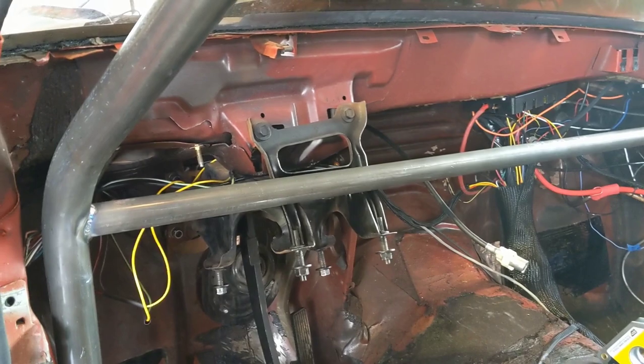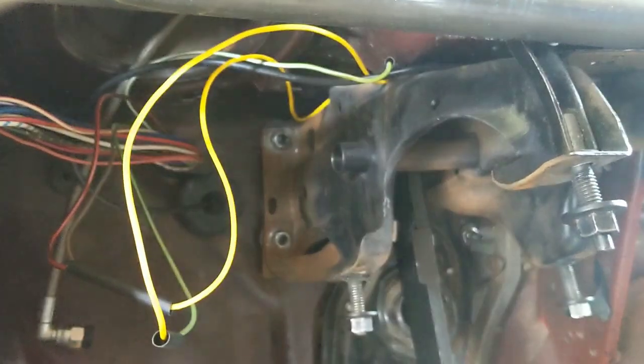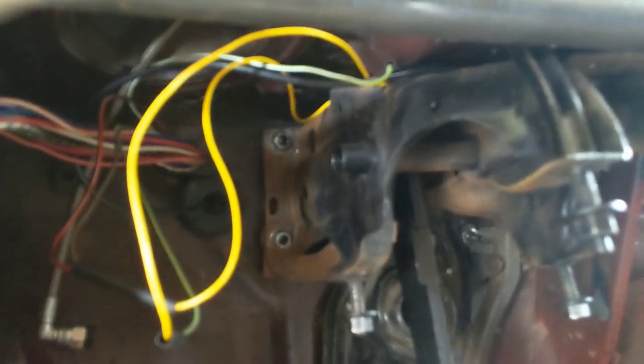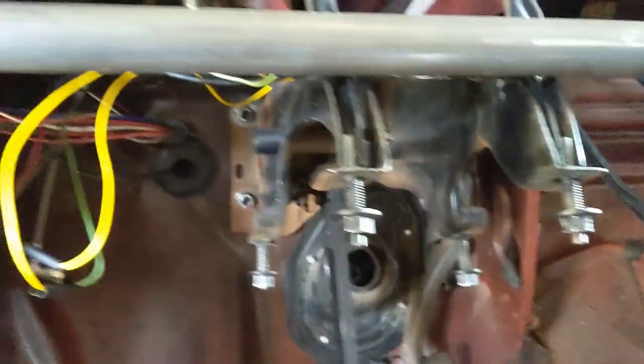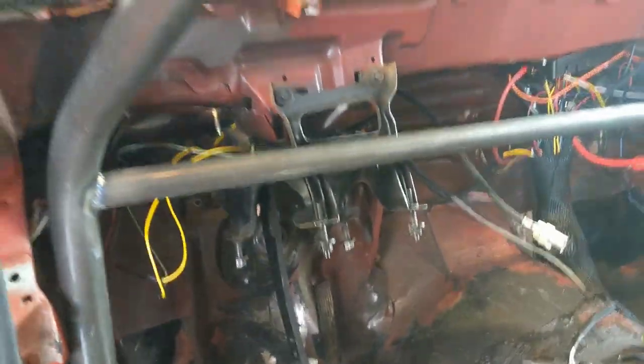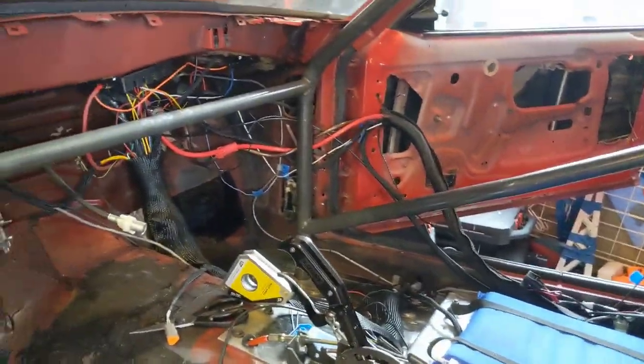I think the problem is I would have to pull the studs out of the back here from the master cylinder, pull straight out so that this whole deal can drop down. I'd have to look at how it's all bolted in. Obviously, there's two bolts at the top, but with this stuff out, we're going to release the ratchet strap, see what happens. Hopefully it comes down and I have plenty of access to the top. If it gets hung up on that steering column box and I don't have enough distance to weld out the top, it's a problem.